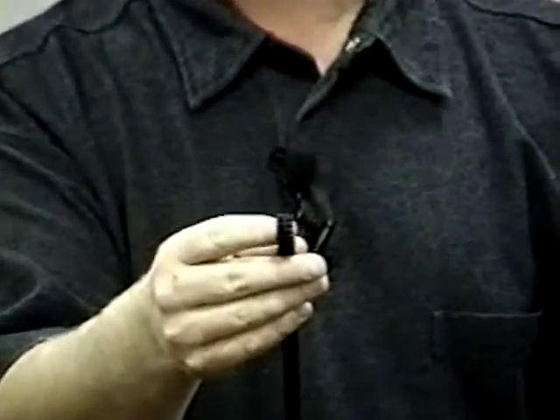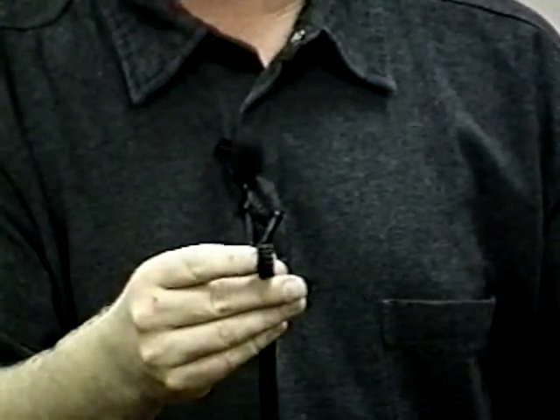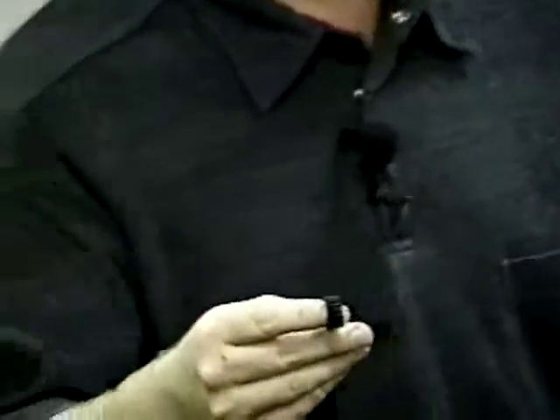Back to the belts. Kevlar belts are not going to stretch. The only thing that's going to happen to a belt as far as wear is this groove is going to get deeper over time, and it's going to get wider over time. This groove is right down the middle and it's where the blade sits. What happens right off the bat — within a few hours — is that groove turns from a triangle into a U.